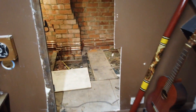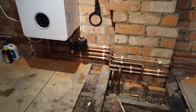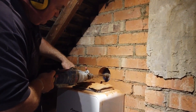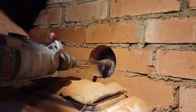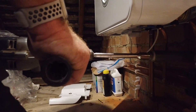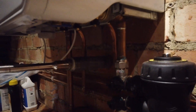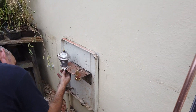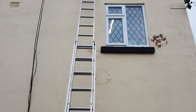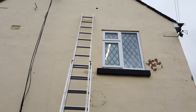Every floorboard has been ripped up and pipes have been installed underneath - it's a work of art. We still need to core drill the flue pipe outlet and inlet, and there's one more radiator to fit in the bathroom. The gas meter is being removed, the gas pipe is being run up the outside of the house - I don't do ladders - and core drilling is going on upstairs: one for the gas pipe and one for the flue pipe for the new condensing boiler.